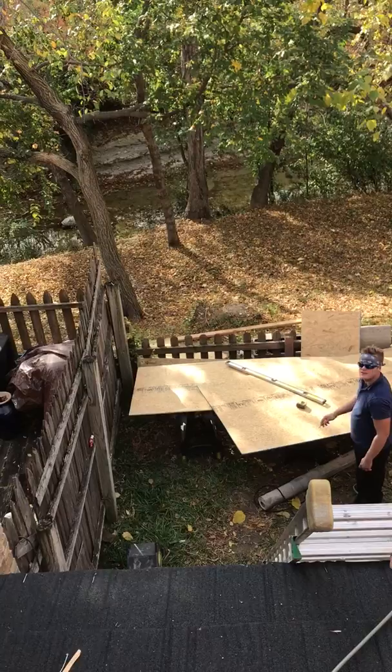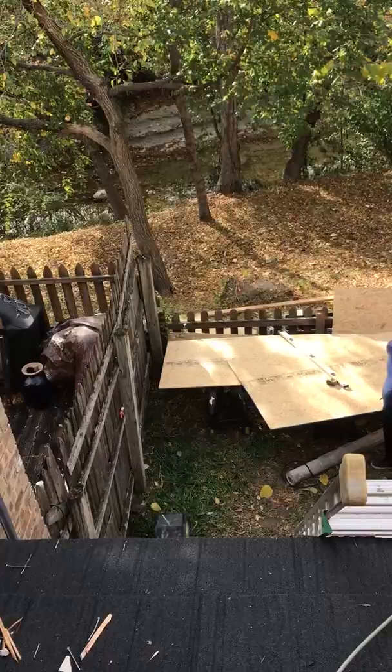Yeah, so I got a measurement here, a measurement there, and then I gotta do this level. A 38. Okay. You know what? That's a 4 foot level. That's a 4 foot board. That level will go all the way across. If you have two marks on that board, it will go all the way across. You don't need three marks.